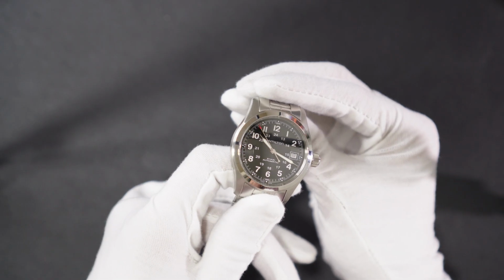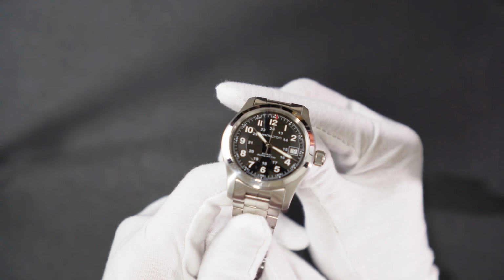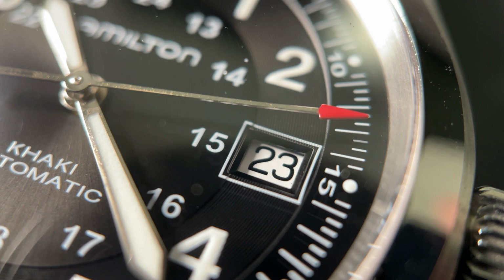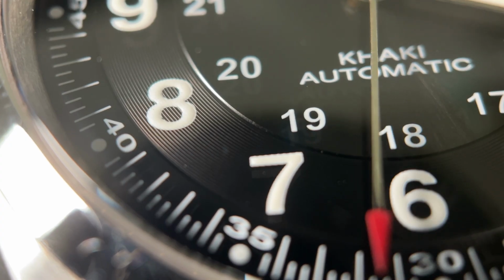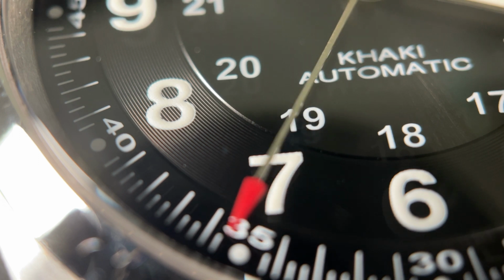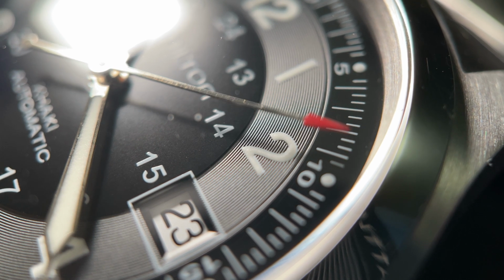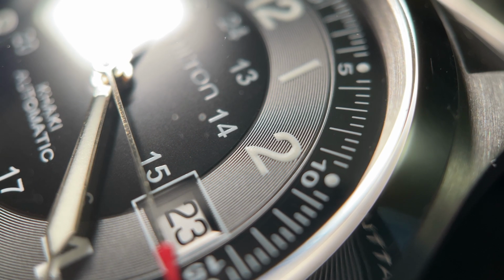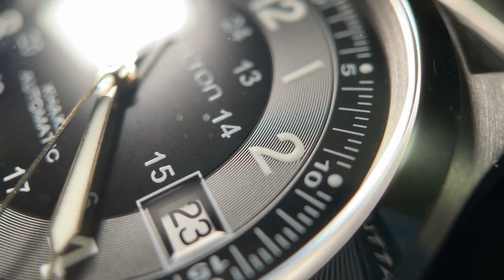Now at first glance, the dial may not seem particularly sophisticated. However, if you look closer, you realize that quite a lot of work has actually gone into making it. While the true originals had a plain matte dial, this one actually contains 3 different finishes. First, we have the outer minute track featuring a smooth matte black surface with a printed chapter ring. Moving further in, we have an hour track that is finished with radial grooves cut into it and lumed hour markers printed on. I mentioned earlier about how legible this watch is, and that is largely because of how well these radial grooves capture and reflect light at a different angle from the rest of the dial. This creates a strong visual separation that makes the hour markers stand out even in bright light despite the lack of AR coating.